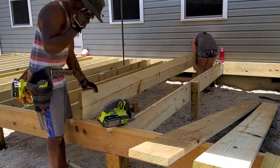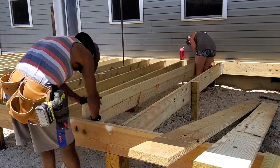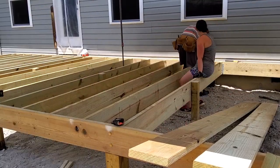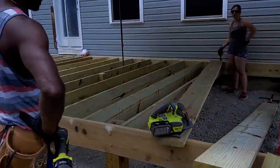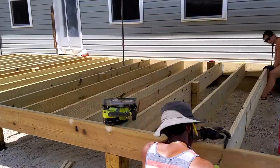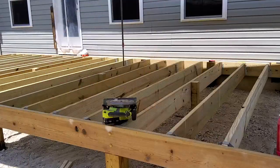So when you're putting the joist up, you want the crown up, so that on the long run, when it starts to take load, it actually bends down there rather than having it inverted and constantly buckling in the middle. So just make sure you have the crown up rather than having it down. It's something we learned over the days of building the fans and the deck.